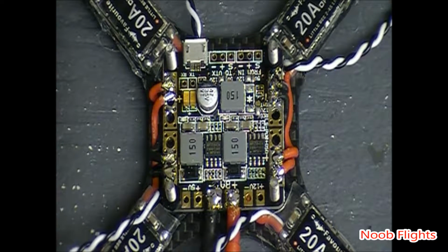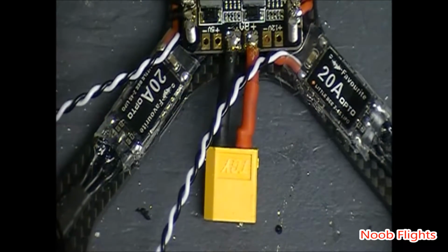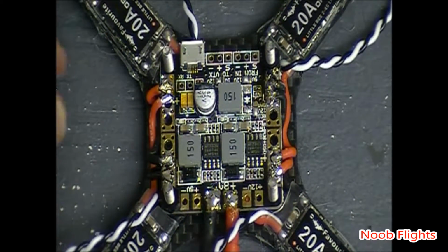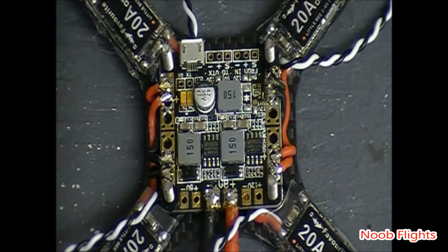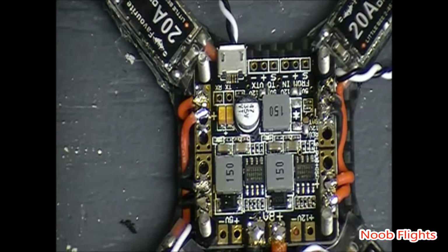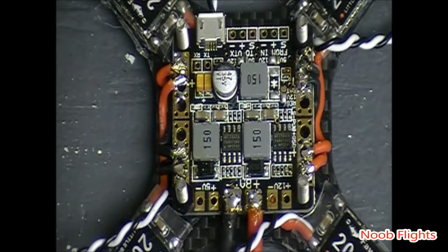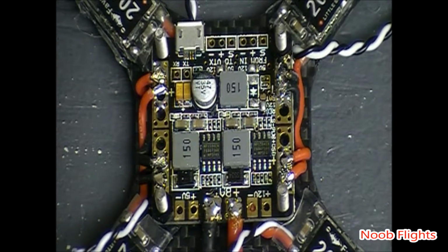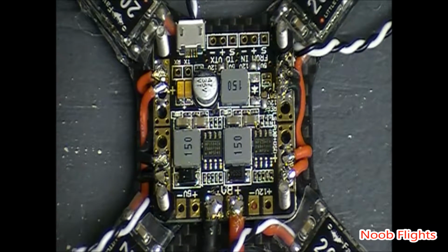But guess what I did? I got a multimeter out and checked it after I soldered on this connection. Now, some people are thinking, oh, that's not nearly enough solder. But if you'll notice, every one of my joints are super clean, very nice and neat. Oh, get that back in focus. There we go. Nice and shiny, and that's what you want. People worry about strength and gobbing solder on there, and all you're doing is creating a giant resistor, basically.